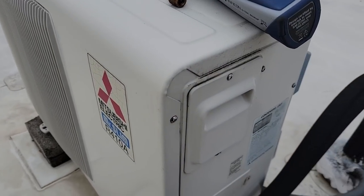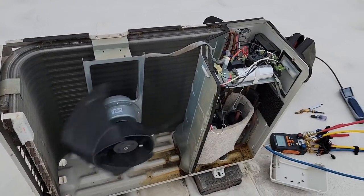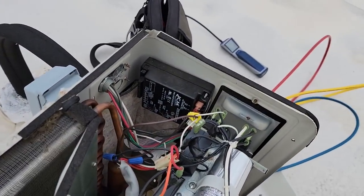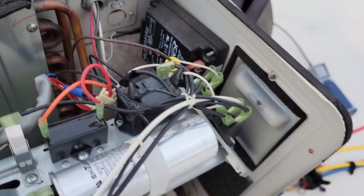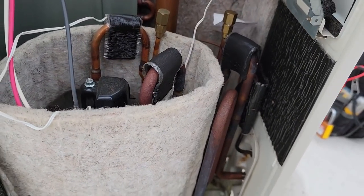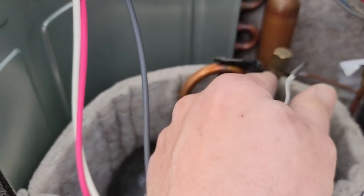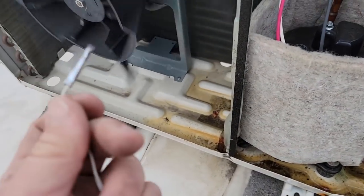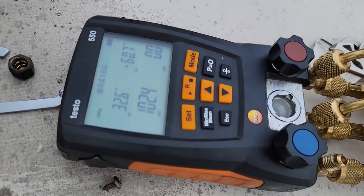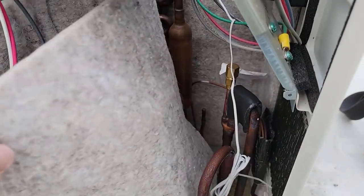Best way to do these is pull it and weigh it in. Let's see if we can find any leaks. It's pretty cool and pretty windy up here. Looks like we've got — are you serious? They literally have a low ambient control on this thing. This must not be a variable speed unit — it's not an inverter drive, just a generic air conditioner. They had the liquid line sensor on the discharge gas and it wasn't even strapped — just wrapped some insulation around it. Unhooked it. It's slowing down the motor, so obviously that's starting to make a difference. Coming up above freezing now! Maybe there is no leak — maybe it's just an issue with the placement of the low ambient kit.